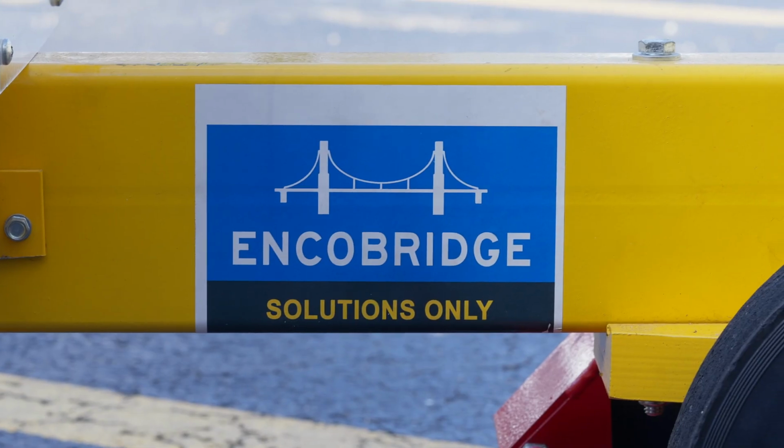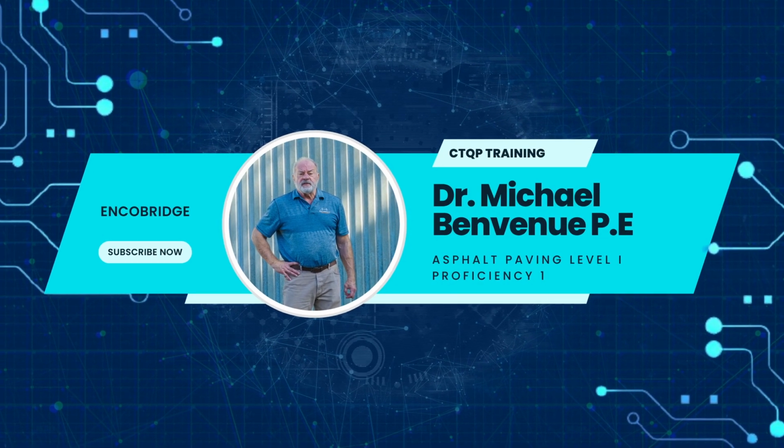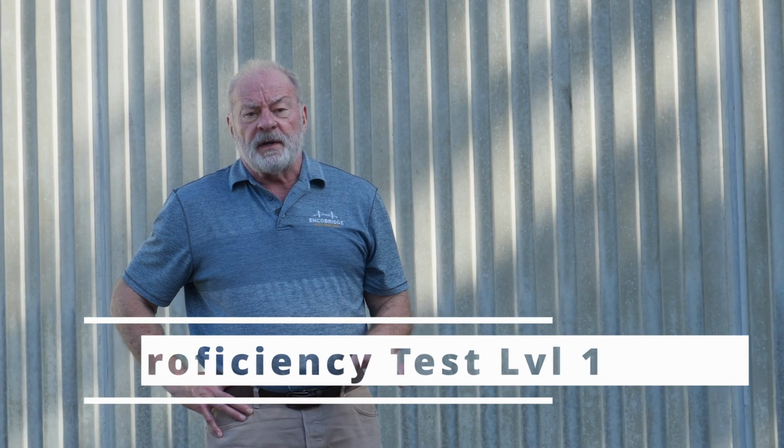So we're going to learn how to use the 15-foot rolling straight edge, which is used to identify surface deficiencies on a new pavement. The test method is FM 5-509, and we're going to learn it because this is what the proficiency test for level 1 is going to be.